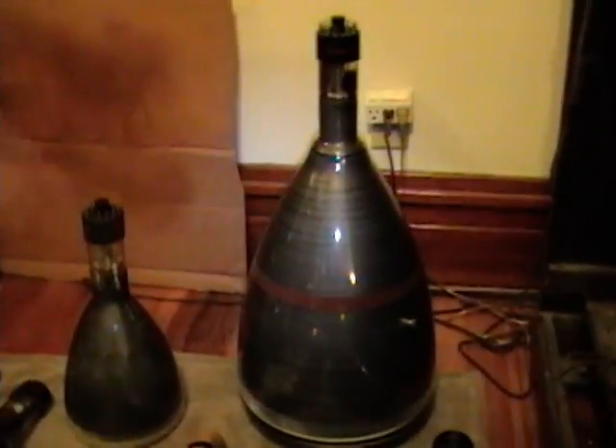And they are pretty wild. While I had these out it got me thinking that they're not all that dissimilar looking from these TV picture tubes - it's the same base. When I looked up the data for these tubes, the pinout is mostly the same. The main difference is this has that high voltage connector up here whereas these feed it into the base. So what I'm going to try to do is make an adapter socket and hook one of these up to that set, and it should be pretty wild.